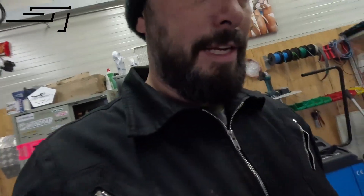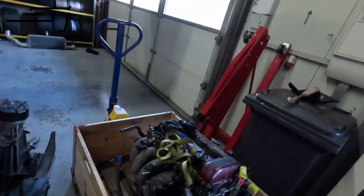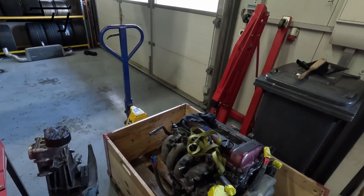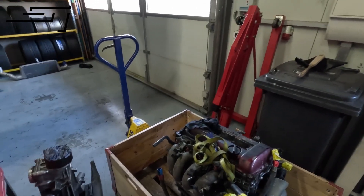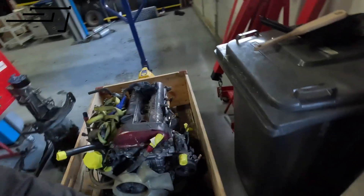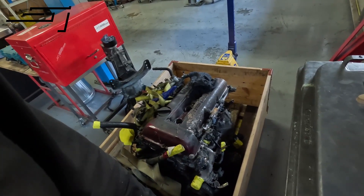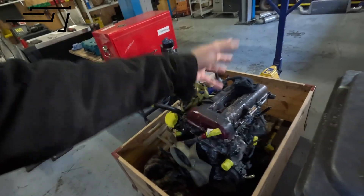I also started cleaning the engine slightly — I took off the turbo. It's here on the pallet and it has to go up into the engine room. I have to get a new cover for it. I think the engine should be okay and the turbo should be okay, but it will need new lines. All the wiring is shot. I'll be putting in new gaskets on the hot side, a new VTC timing unit — I'll have some of those upstairs — and some new lines on this side.